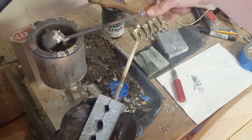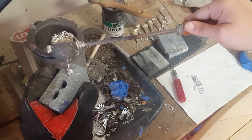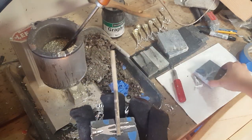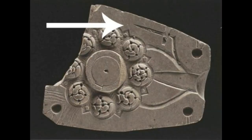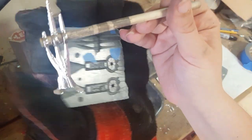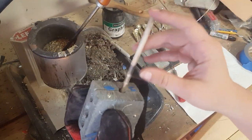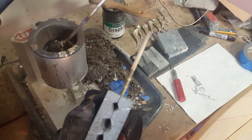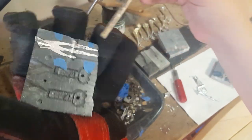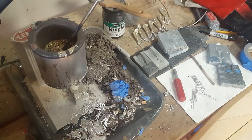Now I need to cast the pin or prong of the brooch. I'm reusing an old mold I made previously that has several prongs in it. It's based on pre-16th century stone molds. There's a hole on the side of the mold for inserting a wooden dowel, and when I open the mold you can see how the dowel creates a half-circle form for the metal to cast around. I've been using the same stick for several hundred casts and don't see any noticeable scorching — the pewter is just too cool to harm the wood compared to metals heated to much higher temperatures.